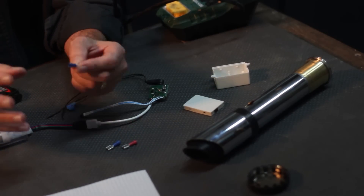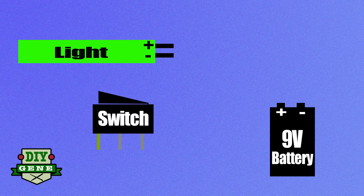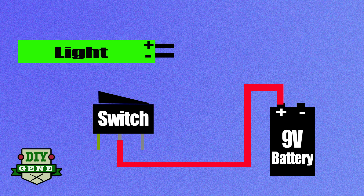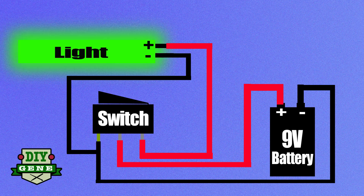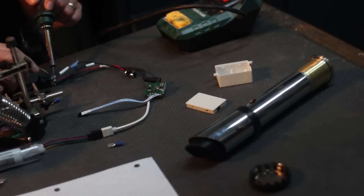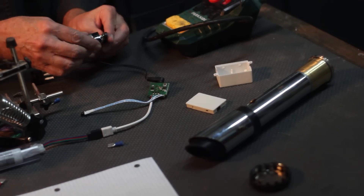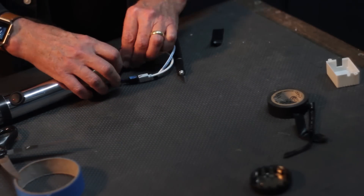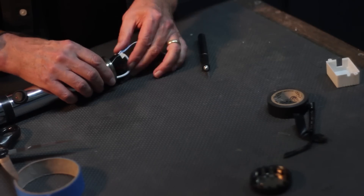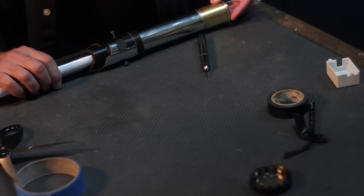For me, I still need practice soldering anyway, so I'm going to solder mine. Basically: you have a 9-volt battery, a three-prong switch, and the light source. The 9-volt positive runs to the center lug, the end lug or switch lug goes to the positive side, then from the copper side to the negative and also to the light. After finishing soldering and adding heat shrink, I'll set the battery in, turn the switch on to test it — looks like it's going to work. I'll tape the circuit board to the bottom of the plastic tray and gently slide everything inside, leaving the battery as the last part.